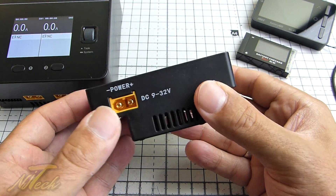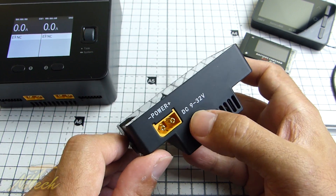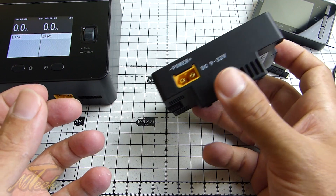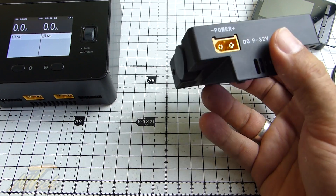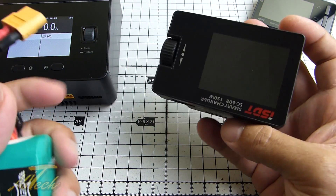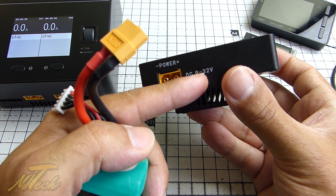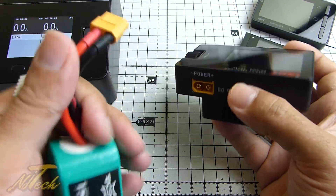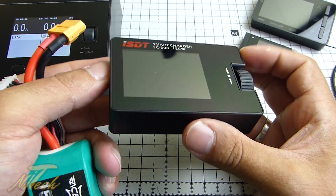One of the biggest things I loved about this charger was its enormous wide input voltage range. Where a lot of cheaper chargers tend to fall over is they tend to not be able to accommodate the higher voltages. If you have a bunch of 6S packs or something — a large capacity LiPo to take down the field to charge your smaller lipos, your quad-size lipos like this 1500 milliamp 75C pack — you really need something pretty hefty. Catering up to 32 volts, you can put a pretty big pack in there, and it also has a nice 2–6S input option.